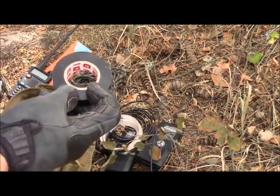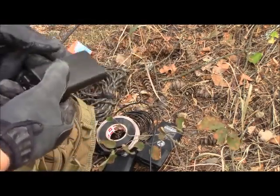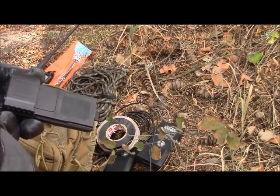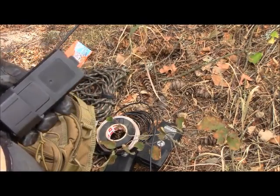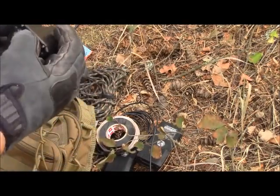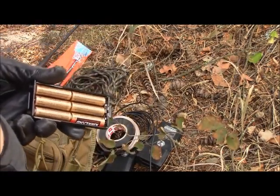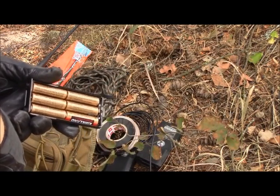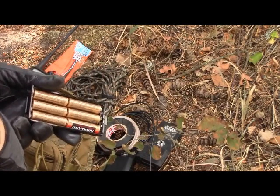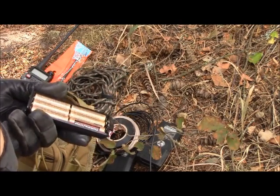No comms go bag is complete without a roll of electrical tape — multiple uses. Finally, in the battery department, I included a AA pack. It looks just like the long-life extended battery, but this one opens up where you can put AA batteries into it. You want to use alkaline batteries, not rechargeable batteries for these. The rechargeable batteries don't have the voltage you need to get a good full signal, and the radio does not like being used with rechargeable batteries. So have some alkalines with you.